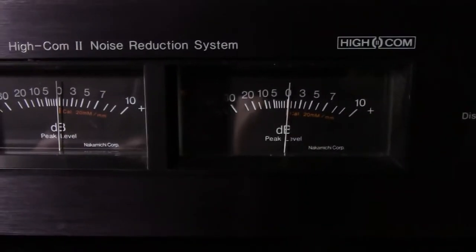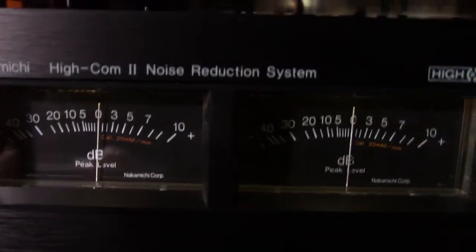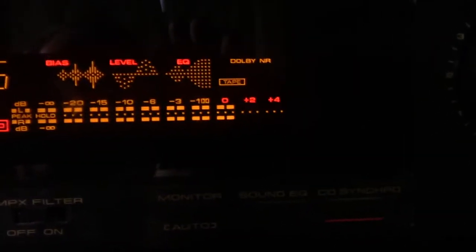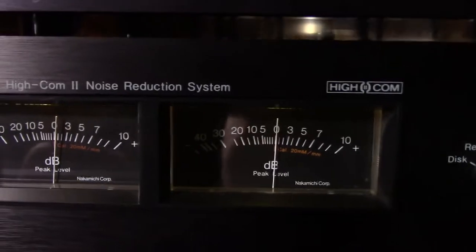On the playback unit it's supposed to be showing the exact same reading, and it is, because it has been calibrated to show that. Now that I've got it in the source position, I can switch to tape. I'm going to switch to tape, and what you do is set the levels to zero on the cassette deck. Then when you're playing back on the Nakamichi, everything is set to zero — so these components are completely calibrated to each other.